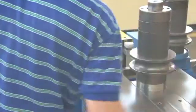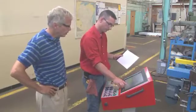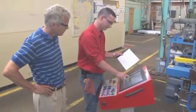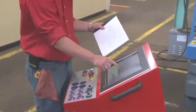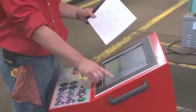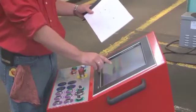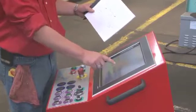To show the control capabilities, Ben is going to program a multi-radius part that might be used in something like a roll cage for a forklift or earth-moving equipment. He adds one program line at a time from a quick sketch. The first bend is a radius of 96 inches and he wants it to be 24 inches long — you can enter either the length or the angle and it calculates the other. He then adds another segment with a 14-inch radius.